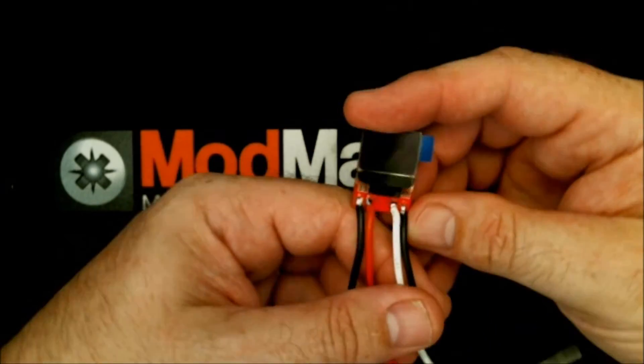That's the mod meter version 2. It works perfectly with Raptor builds, with Murata OKL and OKR boards, and works perfectly with p-channel MOSFET builds. But it doesn't work with n-channel MOSFET builds — connecting this to an n-channel MOSFET build will make your mod auto-fire. Regarding PWM, it doesn't work well with PWM. It will display the voltage-in and the resistance of your coil perfectly well, which is handy to know, but if you're looking for accurate wattage numbers you won't get them because PWM doesn't output a straight-line voltage. It's the same for any voltmeter — numbers won't be accurate until you're at 100%. You will be able to check your battery levels though, which is quite cool.